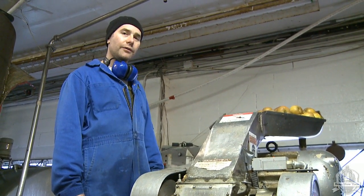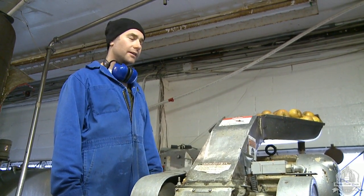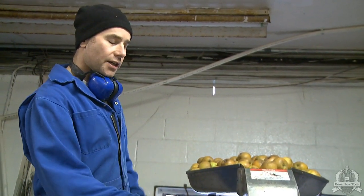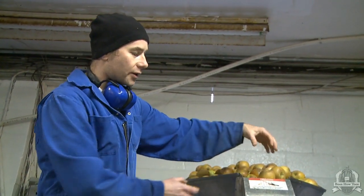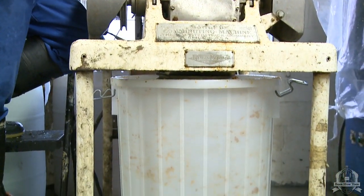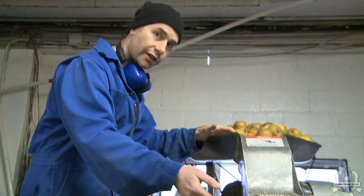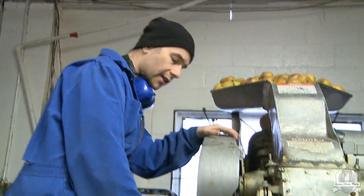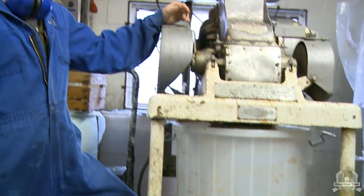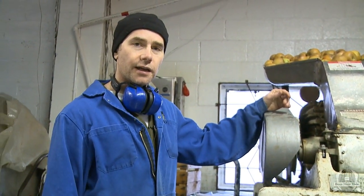There is no better or faster way I know of to mill my fruit. The pathway is simply to start the mill up — there are big blades spinning around inside, and a big honking electrical motor. The apples drop through the hopper on top, down the chute into the mill. The spinning blades shred the apples and they're forced through a little screen inside. Only apple bits that are sufficiently mushed can get through the screen. Then they land in this bin — 40 pounds of apples might only fill it a quarter or a third — and then I'm basically ready for the press and can scoop it out to the next stage.